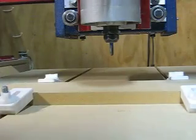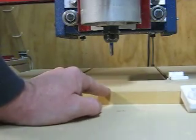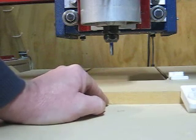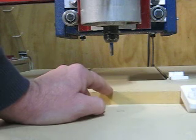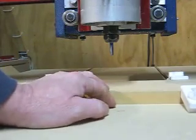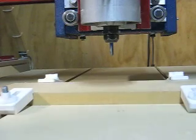There's a very good reason for doing that. MDF comes in varying sizes — MDF in New Zealand is sold as 18 millimetres thick, and if I ever find an 18 millimetre thick piece of MDF I'll probably frame it. This piece here is just over 18.5mm. Some is under 18, some can be as high as 19. Seasonal changes in weather and moisture content will also change the thickness of my material.